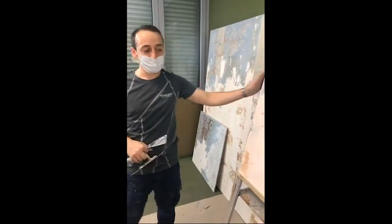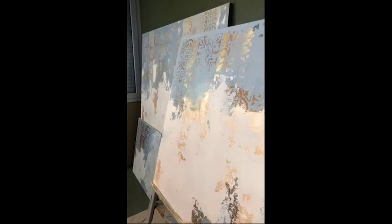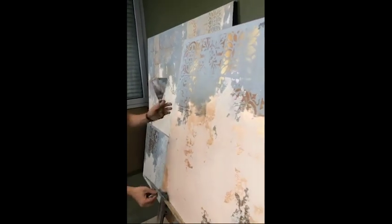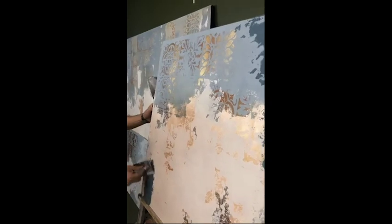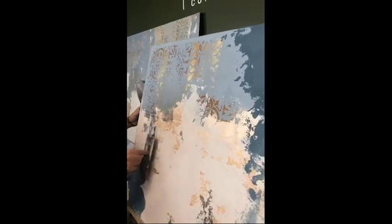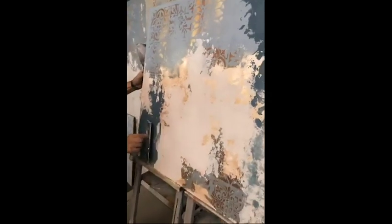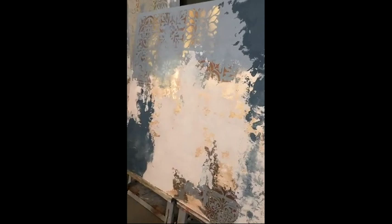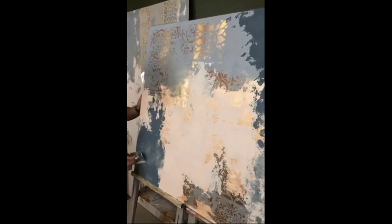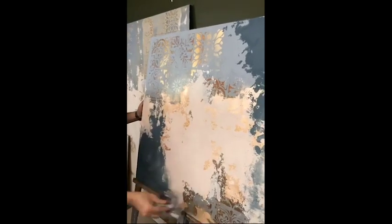When the whole thing is totally dry, as always we can go and protect it — remember this is a lime and clay product, so quite absorbing. Harold is saying we normally use Fase siloxane, our clear siloxane sealer diluted with no color, to keep the original color. Or if we want to use this technique in a much more wet area, we could use instead a clear sealer — a two-pack polyurethane, always water-based — that makes it possible to use similar techniques inside wet areas.